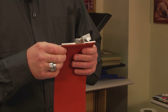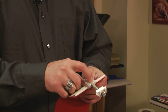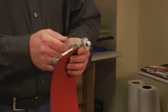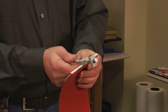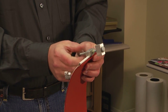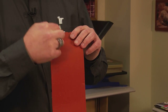How can you tell if you have not greased a wrap properly? Well, the screw will seize in this block. As it gets hot and cools back down, it will seize in the block, and that's a non-refundable event as well. So what you want to do is simply ease the threads down into the block, get them nice and lubricated, and you're safe.